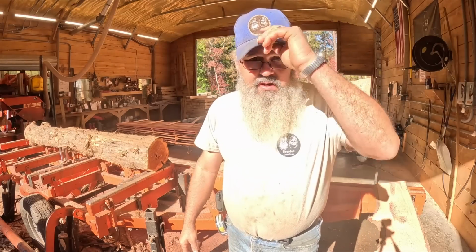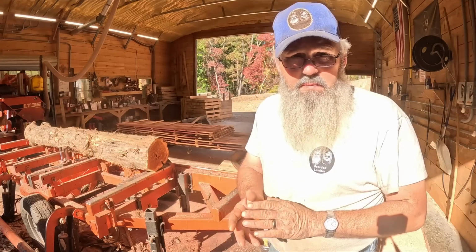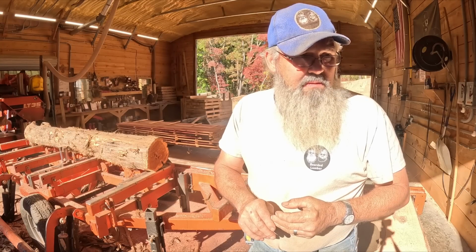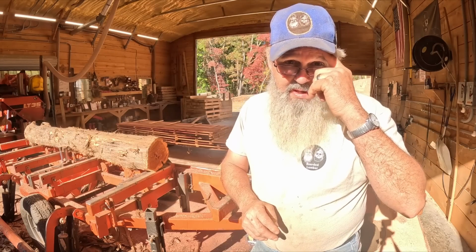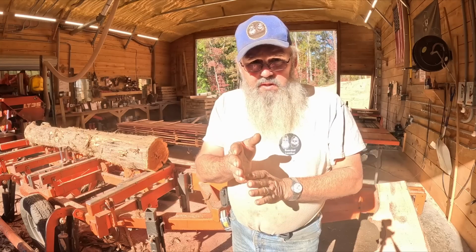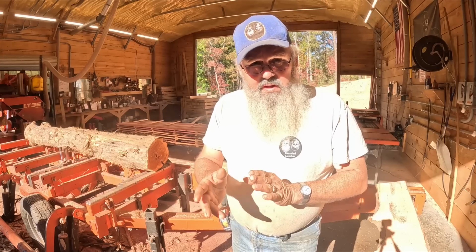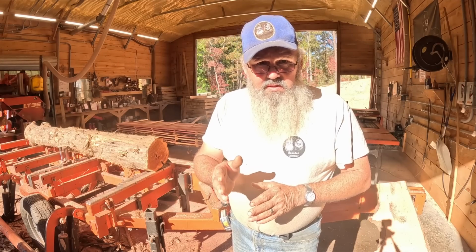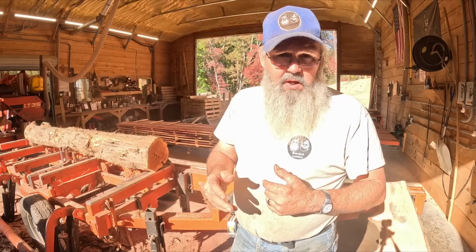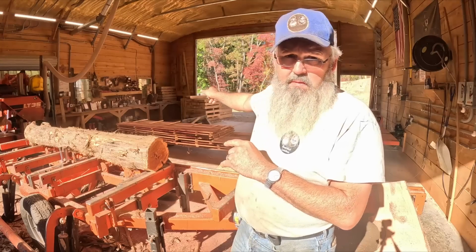Secondly, we broke a blade a little while ago, and it was actually yesterday, but I didn't stop and talk about it. It was a 55 thousandths Turbo 7, and it was sawing great, and I went into the cut, and as soon as I went into the cut, I'm normally watching one or both blade guide rollers, and I seen that blade start to walk. Normally it'll do that, and within the length of a cut it'll break, but as soon as it started to wobble, it broke, and it shot that thing right out the floor.